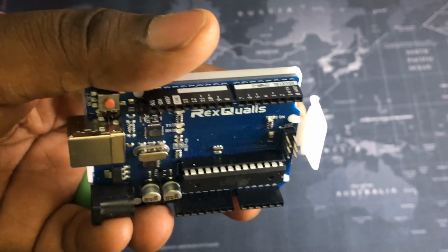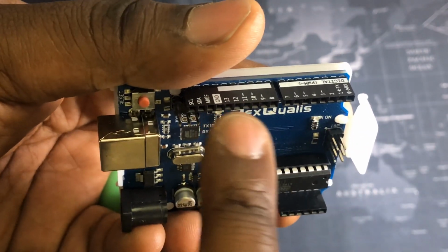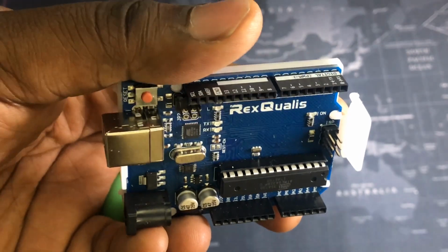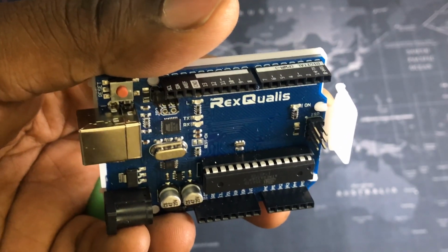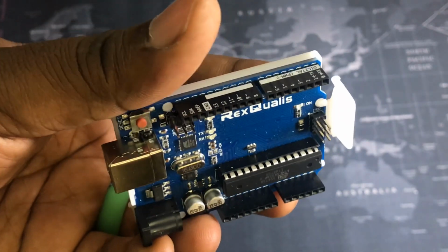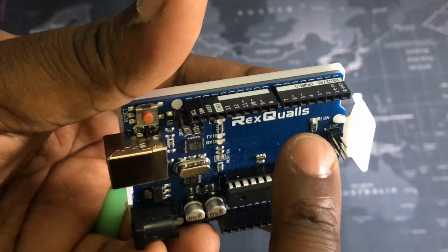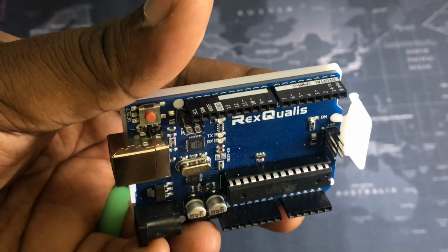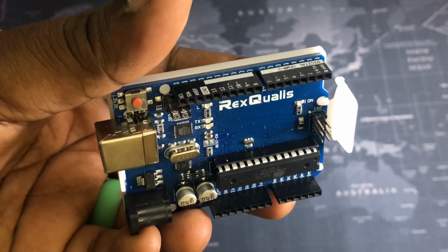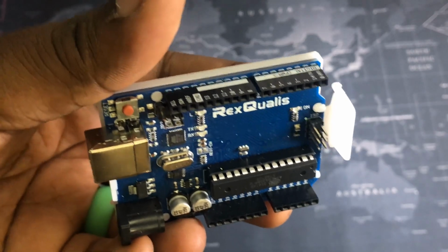Very simple. You can trigger these pins under certain circumstances to trigger a 12-volt relay. So you can use it to turn systems off or on. So in the case of my mode selection on the MR2, I get these pins to send out voltage to trigger a relay, to bridge a ground or send a power 12-volt signal to turn on my boost controller or turn my boost controller off.